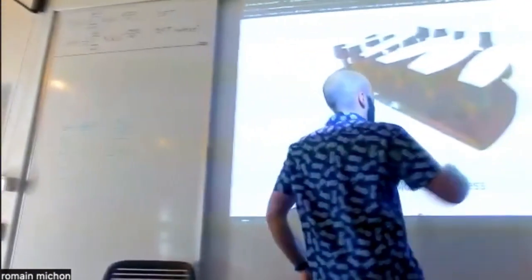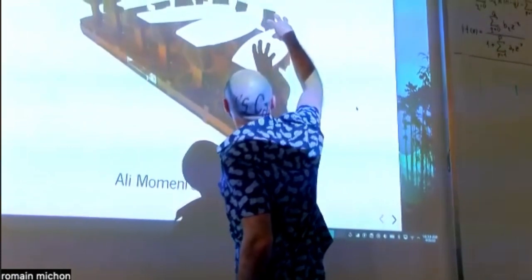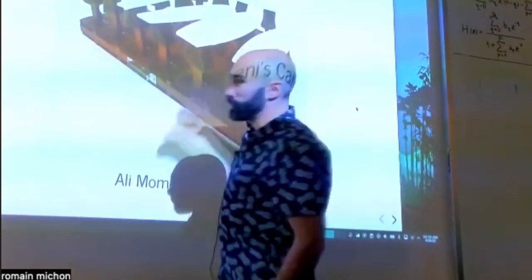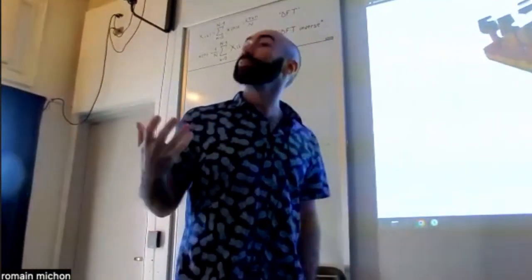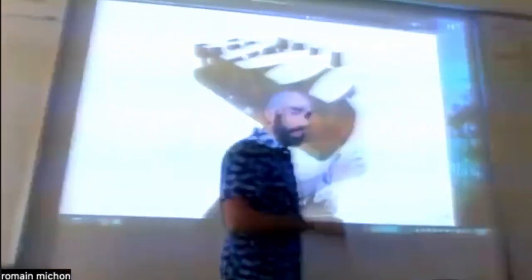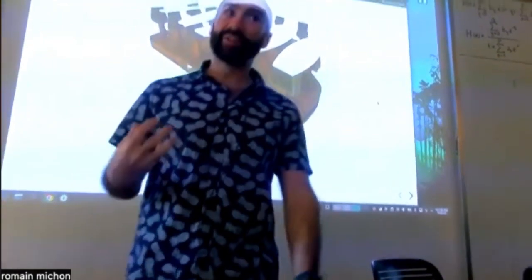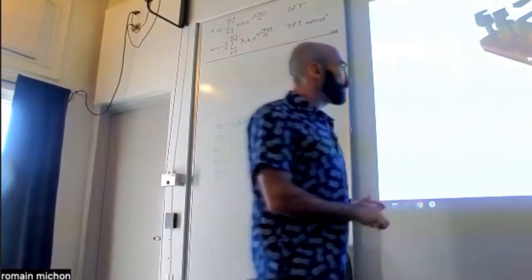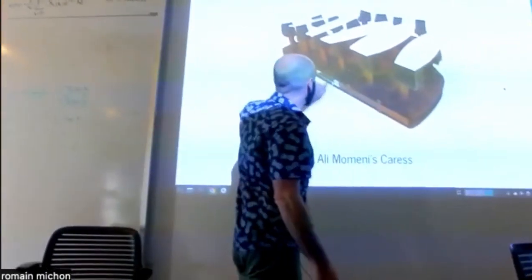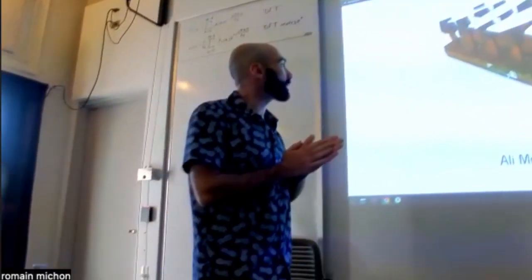except that you have different surfaces, and those different surfaces have a piezo glued at the bottom, and they all have different textures. And because they all have different textures, when you're touching them, it sounds different, basically. Maybe one of them is very smooth, so you get a very smooth sound, and one of them is very scratchy, so you get a more scratchy sound. And then he's using that to drive physical models that are obviously running outside of this thing, which is why he has this big connector to connect this to probably an audio interface.